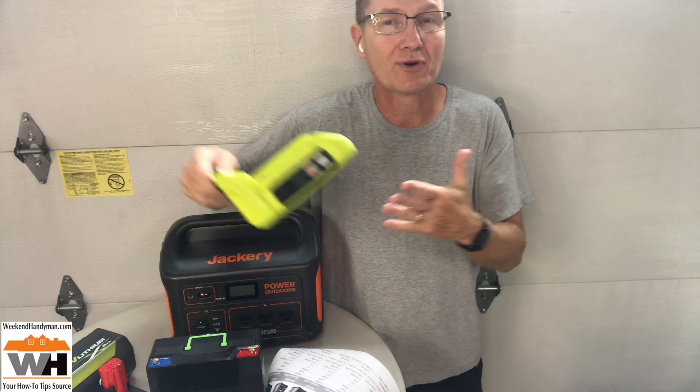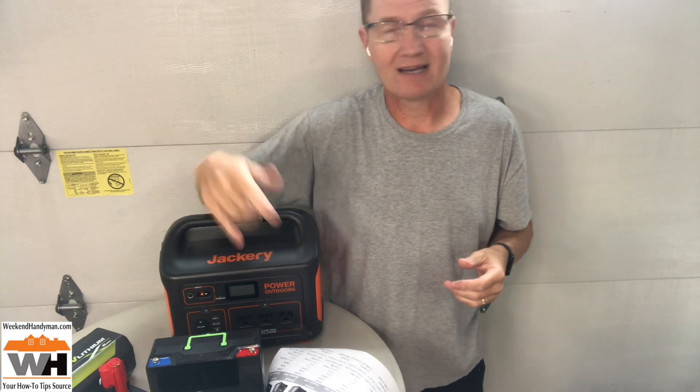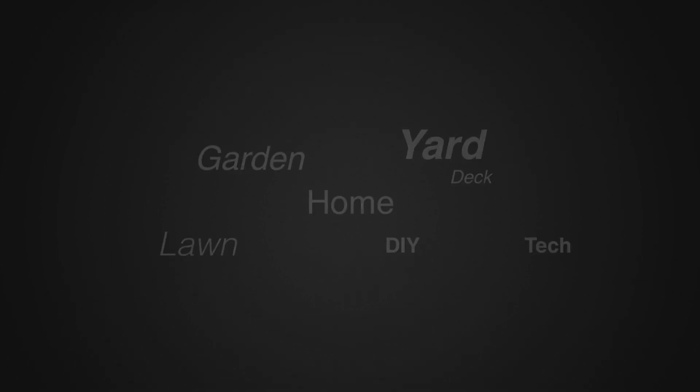Then it becomes a question of whether your inverter is designed to give you 300 watts of power, or if it's like this little Ryobi over here that's only designed to give you 150-watt peak — its happy run spot for that little one is around 70 watts max, and anything above that can make it do weird things. We'll put links in the description so you can check out a variety of different technology in this area. We'll be back with our next video where we're actually going to put some power to these things and show you what I've been talking about. For more tips and how-to videos go to weekendhandyman.com.